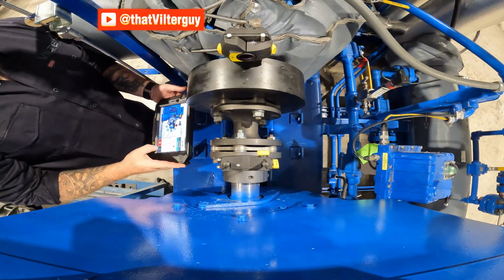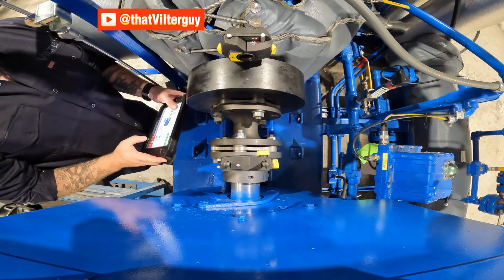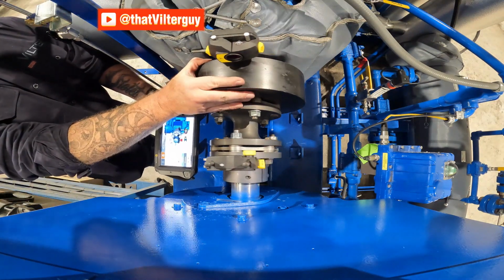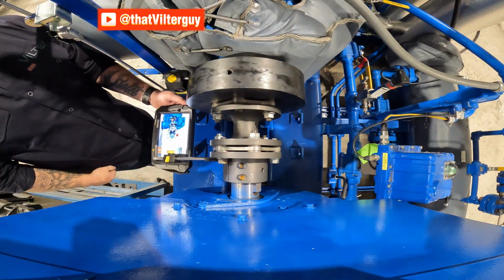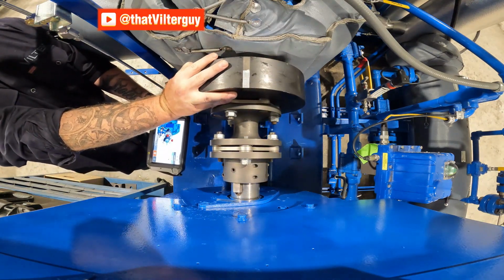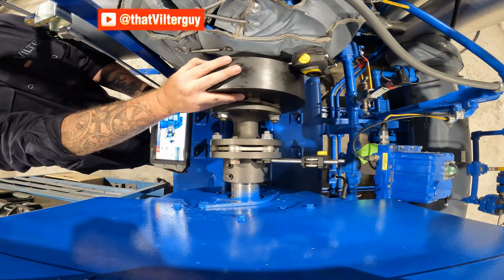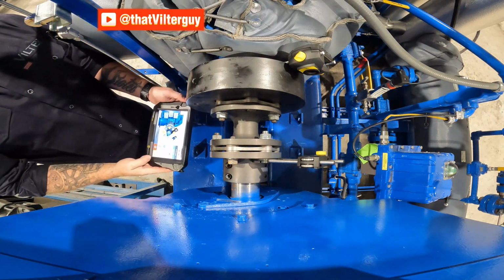And with that, we'll start with a reading. We'll take that first measurement right there. It's reading 1. We'll come down to 90 degrees. I'll take reading 2. I'll come all the way down to 180, top and bottom here. That'll be my 3rd reading. And then I'll swing up, and I won't go all the way, I'll go past 90, and I'll take a nice angular reading as well. And that'll be my final reading.